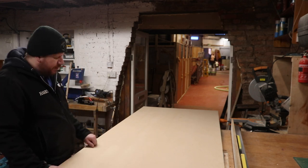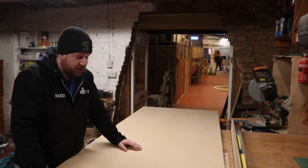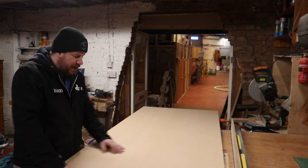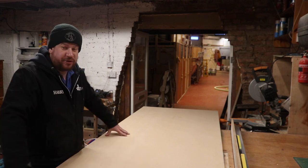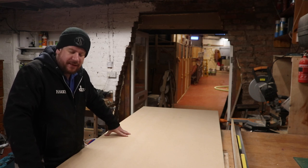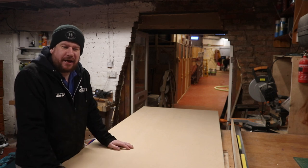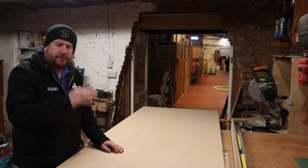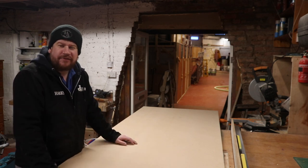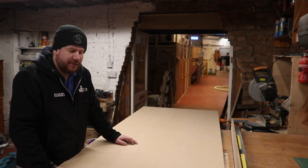So we've got an 8 foot long by whatever I've chopped off the end, off cut of MDF here. I'm going to offer up my circular saw, and then we're going to cut a strip off with the table saw, and then we're going to manufacture an edge strip and a base plate for the circular saw to sit into. We'll put something like a 25 degree mitre on both pieces so they match and interlock, so we don't get any twisting of the saw as we're running it down the workpiece.